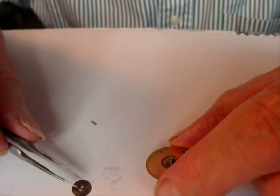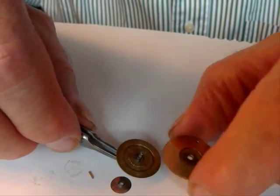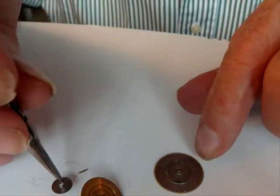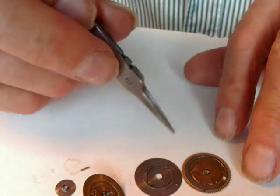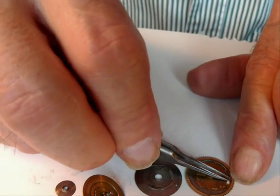the cap, which is normally blue (this one has been sanded down for some reason), the fusee separates into four parts: the brass cone, the end cap, the Harrison's maintaining power wheel, and the great wheel. In the great wheel is the maintaining spring, which you can leave in unless you have to work on it.